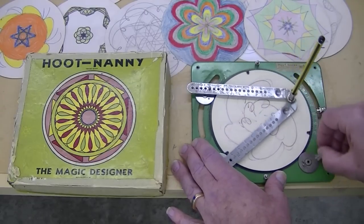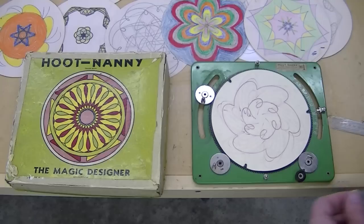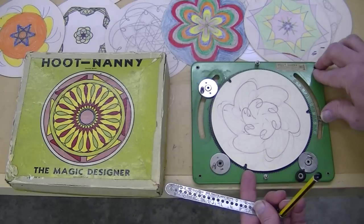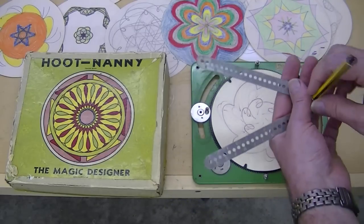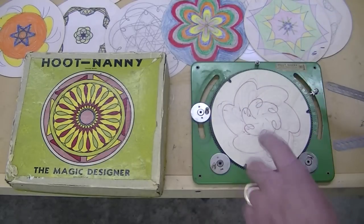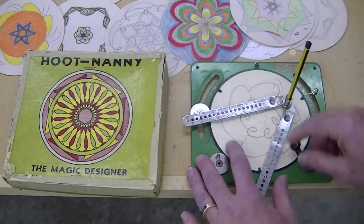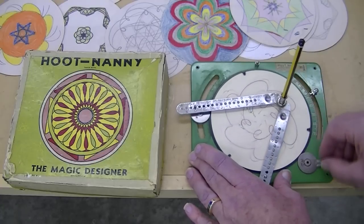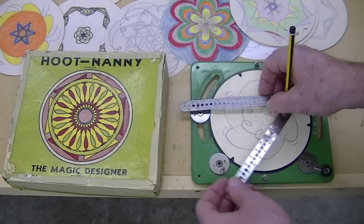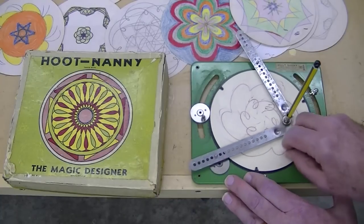So this is limited to drawing patterns with six lobes. But it allowed you to change phase by moving this lever here, and you could get reproducible settings by choosing the right hole combination with the cranks in the right position. You could also use one moving crank and then one stationary point and create, again, a different set of patterns by either choosing that crank or this one with a stationary pin on the other side.